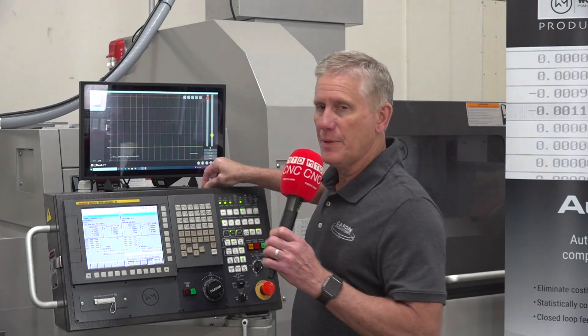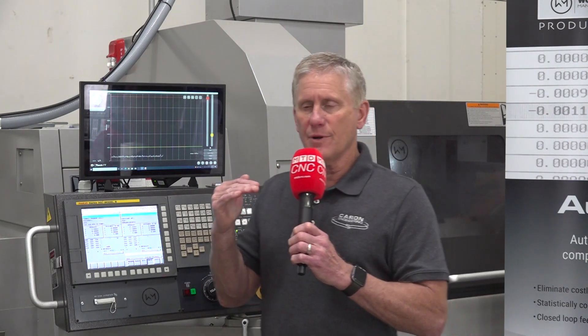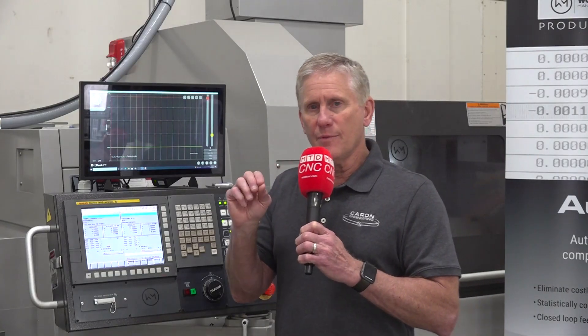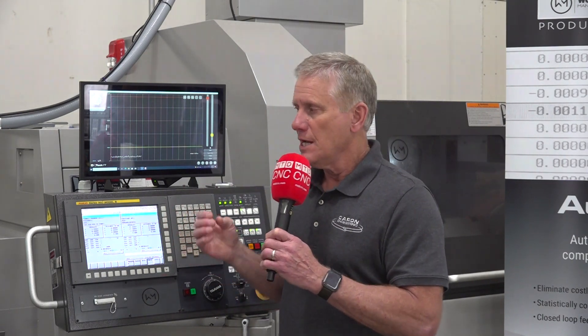This bar is very small — I can almost barely pick it up, it's so tiny. They're really trying to hold tight tolerances here at Wolfram Manufacturing. If the bar vibrates too much or there's a slight bend in it, it's going to cause the tool to deflect against that, which could cause tolerance problems, chatter, and other issues. The key is to monitor the vibration every time.